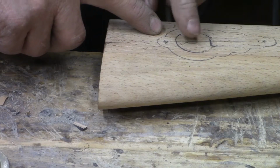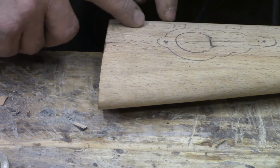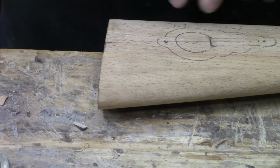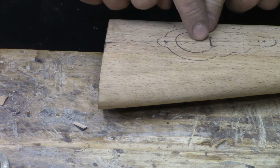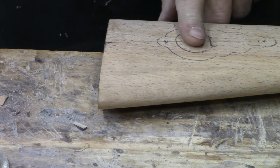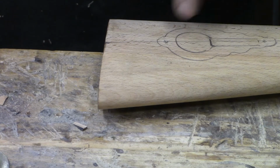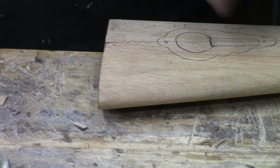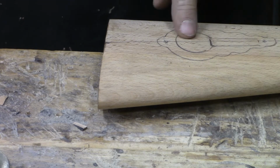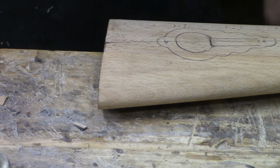So the first order of business, I believe, is going to be this inner circle. It comes out handy because I already got my center line. So all you got to do is get a hole saw, get that diameter, and take that down about an inch. Alright, and then that'll help me inset this piece here for the spring. So our next step is to find the other center to get me a dead center for the hole saw, and then we're going to be making a hole.